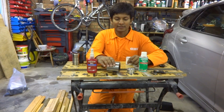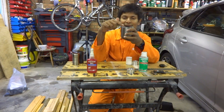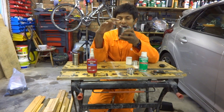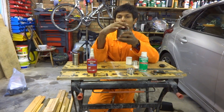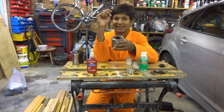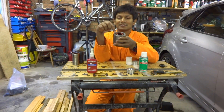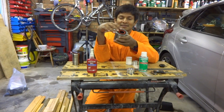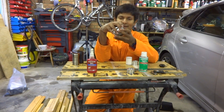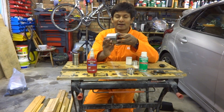If you're really unlucky, what can happen is the face of the bottom bracket shell might not be flat. The Cervelo bike behind me has that problem — the bottom bracket face was not flat. In order to get around that, I had to make my own bottom bracket, which I'll come onto when I talk about fitting Shimano cranks.